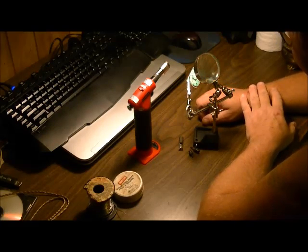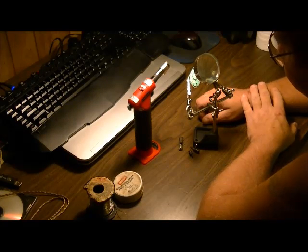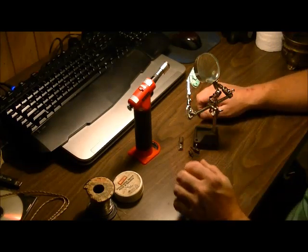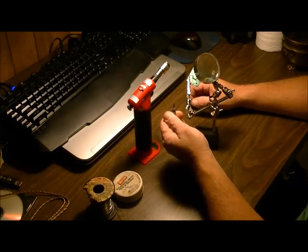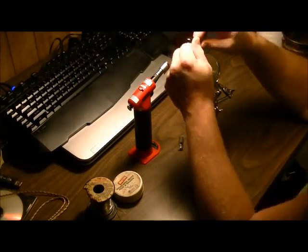Just by taking a quick glance at this board, I can tell you right now I can see at least a dozen bad solder joints on this board that are going to have to be fixed. But we're only going to fix a couple of them just to show you how it works. The soldering tip of choice would be one of these fine point ones when you're working with electronics and PCB boards — you need a finer tip.